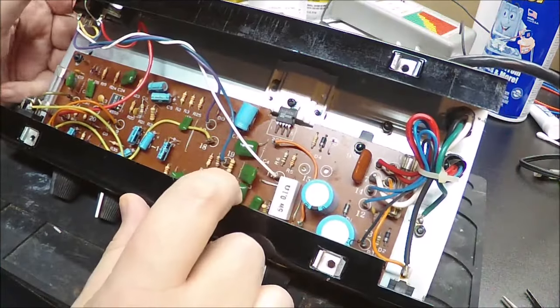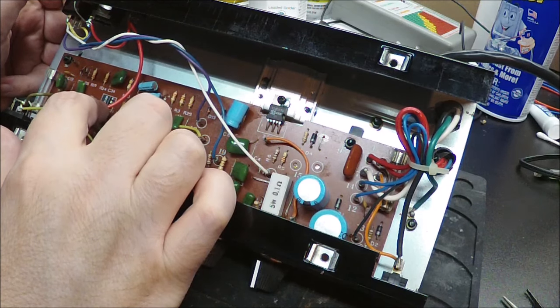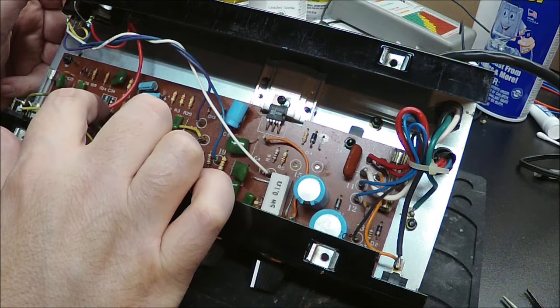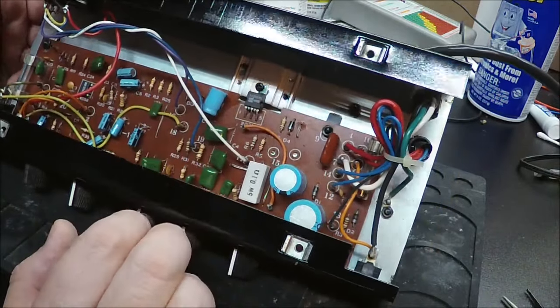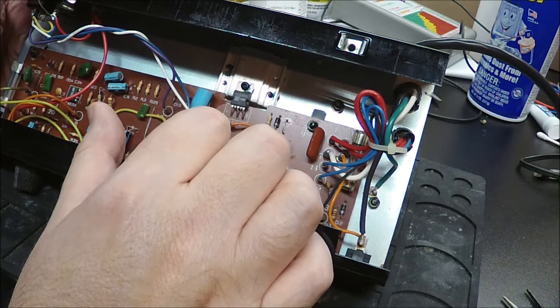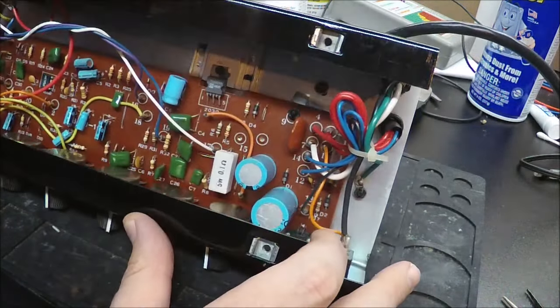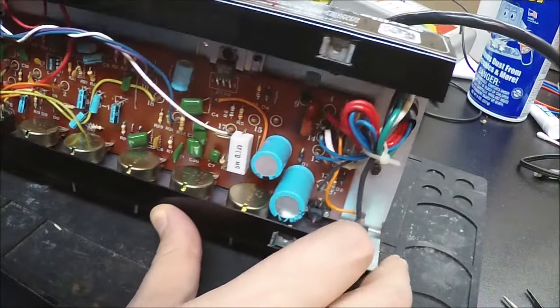Okay, so pretty straightforward amp here. We've got a TP53130N — that's probably an op-amp, I'm not a thousand percent sure, but I'm pretty certain. And our output chip is the legendary TDA2030, the chip that powered a couple bajillion practice amps over the years.